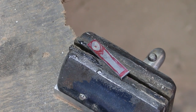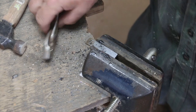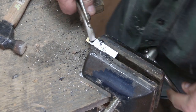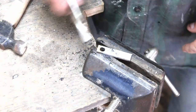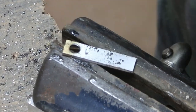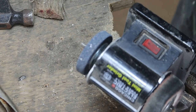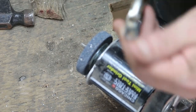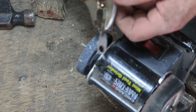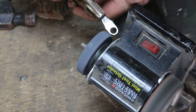Time to pay attention to the tool steel section. The stuff is in the annealed state and I wouldn't say easy to work machinability-wise, but it does machine. Drill the hole first, set the inner diameter. It's a little Grizzly — or Chicago, I don't remember — but it came from Grizzly Tools I believe.